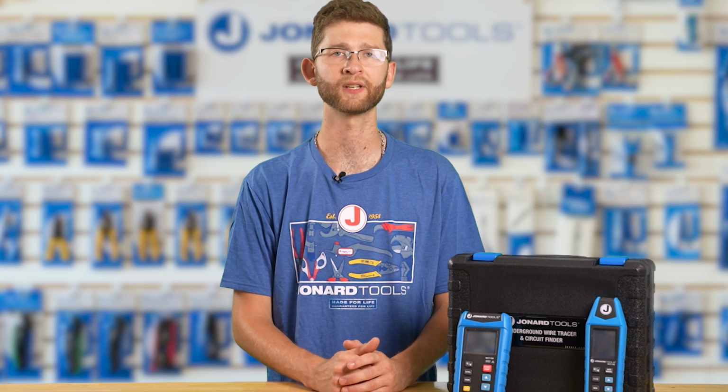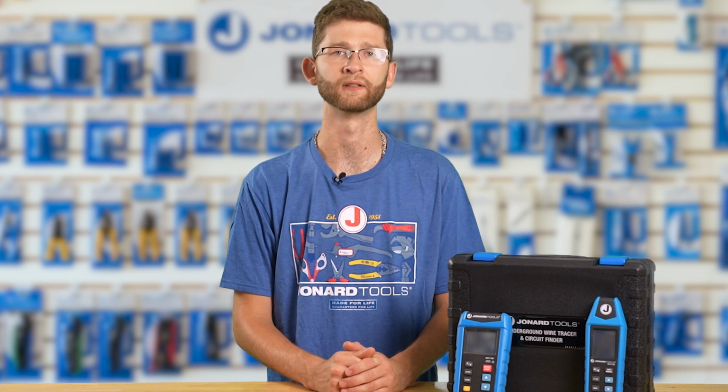Remember, when tracking energized conductors, the receiver automatically detects if the voltage is live and displays the voltage symbol on the screen. By following these steps, you can accurately trace and locate underground or hidden cables using the WCT-700. Practice and patience will help you master this essential skill.